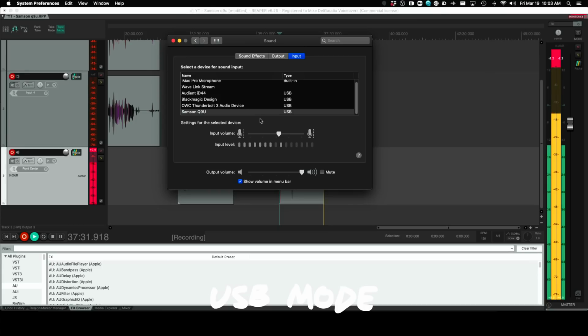What I've found is the preamplifier on the microphone seems to be fairly reasonably set right there in the middle. It's got some pretty good power to it, but there's a bit of a click as you go past the 50% point. I think there's some weird voltage thing that happens when it's sending power over the USB cable, that as I switch the volume right past the midpoint, there's a little bit of click and dropout. It's this funny sounding thing.